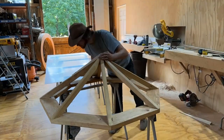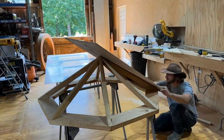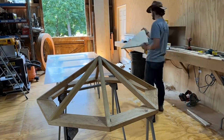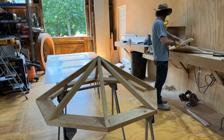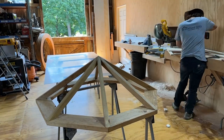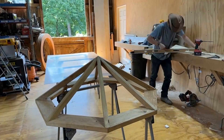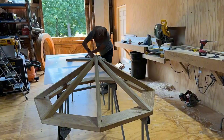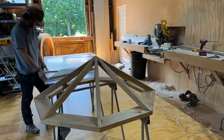So far, we haven't had to spend any money on this skylight. I already had the wood in the shop, and we didn't need much to begin with. But we're going to have to buy a quarter-inch clear polycarbonate sheet — this is Lexan, available off the shelf at Lowe's for around $200. I make a small triangular jig to use as a template to mark and cut the eight triangles we need to fill in the eight panels of our octagon.